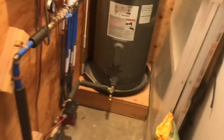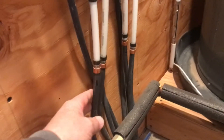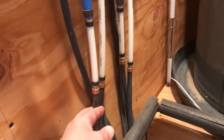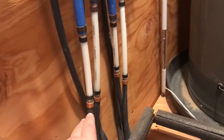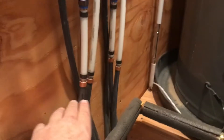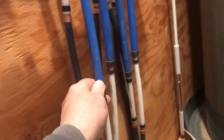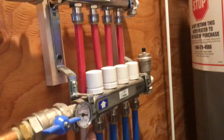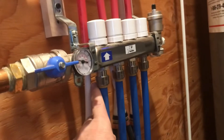Going through the system, we have the original polybutylene coming out of the floor — this is all 3/8ths. Since polybutylene is out of business, we had to convert from 3/8ths to 1/2 inch PEX. The only adapter I could find was 3/8ths polybutylene to PEX. The return lines are blue for cold and the supply lines are red for hot. We converted to 3/8ths PEX, then up to 1/2 inch PEX, connecting into a SharkBite manifold — press fittings with no leaks.